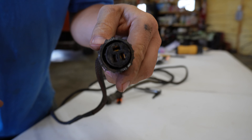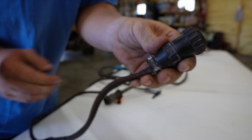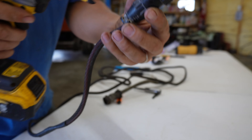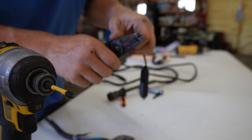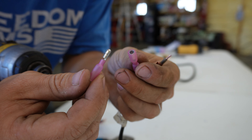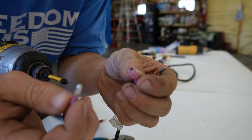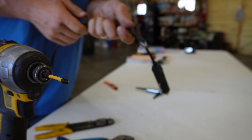Right here you're going to see that there are two screws on this plug. We're going to take those off so we can get this three-prong piece out. There are only two wires that go into it, and we're just going to put a cigarette lighter adapter on it, because that's what's going to work well for our tractor. I'm using this style of connector because it allows me to basically unplug the cigarette lighter if I ever needed to put something different on there.